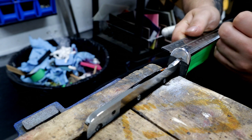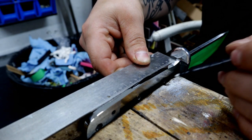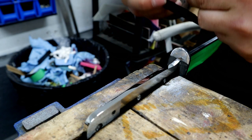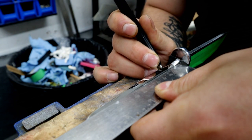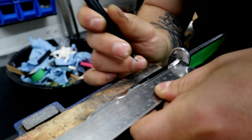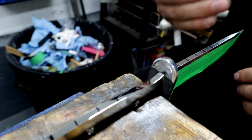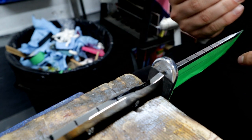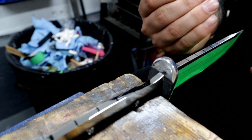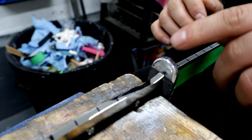So we mark up to the pommel — this is a unique case because we have the pommel breaking the design, so something to be mindful of. Do the same thing on the other side. Now, we need to make cuts along these lines. Remember you can't do straight down cuts or sliding cuts, so we have to do roughly 45-degree cuts. We offset, cutting every second one on this side, then go back and cut every second one on the other side, so we end up with a beautiful wave all the way down.